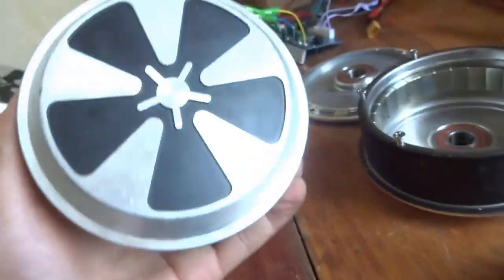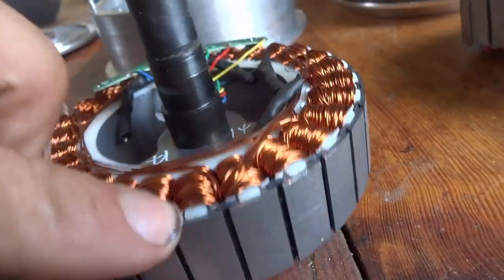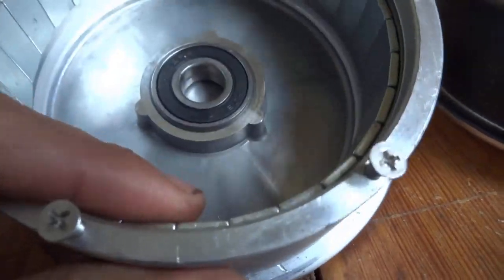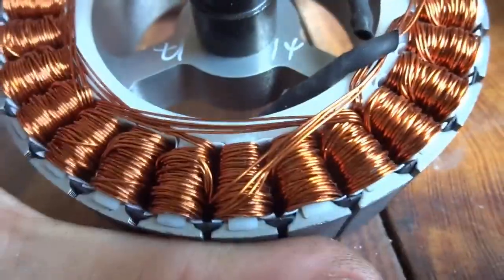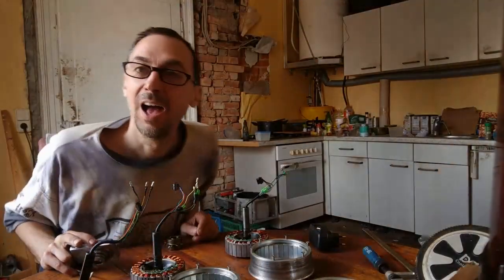This one is the most common design — 350 watts — and it is 25 millimeters with magnets already about 2.5 to 3 millimeters in height. Interestingly, this motor has three windings in parallel, I think 0.3 millimeters wire. This one has four in parallel, and this one has five in parallel. So more current can flow through these motors.